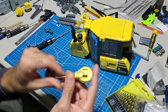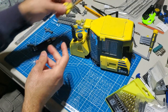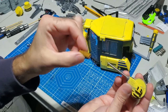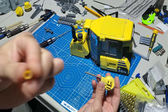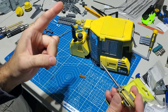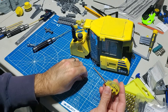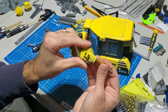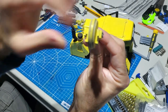Let's assemble the idler. There's going to be this little spacer, then the spring - this is a spring from an Ender 3, so if you have an Ender 3 and buy extra springs, this is what you'll want. You're going to need a four millimeter shaft; these come in 100 millimeters, 200 millimeters, whatever length. The four millimeter shaft goes into this hole here, and what this does is create the offset we need to put enough tension on the tracks.